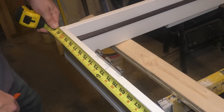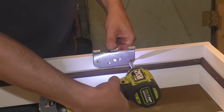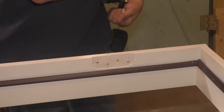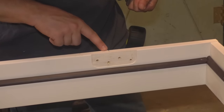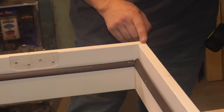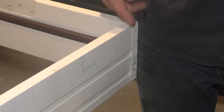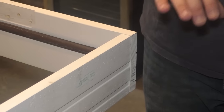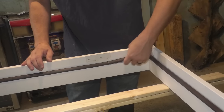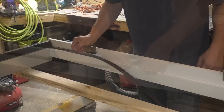I'll just take that hinge off and then mark 71 and three quarters on the other side. So this is the top of my door frame or jamb, whatever you want to call it. Things to keep in mind while you're doing this: go up here and see how this is built — you want to recreate this exactly. So when I cut that line, what I'm cutting is right here. You just want to investigate all that kind of stuff before you go cutting. I'm just going to take this piece of weather stripping right out on both sides. It's easy enough to remove and put back in — I'll just let it hang right there.